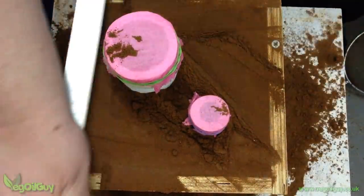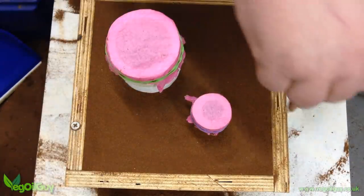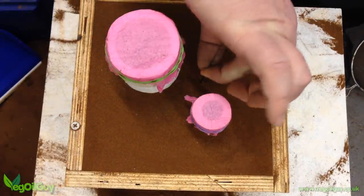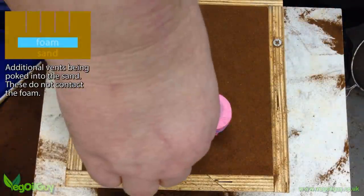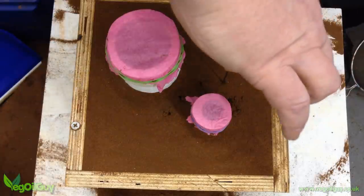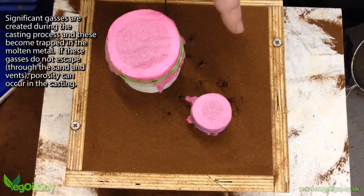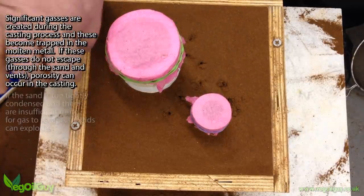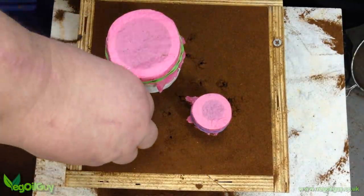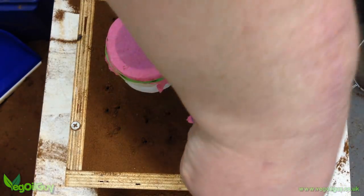Eventually I strike off the sand and brush away any loose excess. Now this is a fine metal rod — it's actually a bicycle spoke. I carefully judge the depth to make sure I don't get within an inch of the foam, and then it's a matter of poking random holes into the sand. It's a tip from Martin that you may have seen me using in another video. Compressing the sand too much is dangerous — as the foam evaporates and even as the metal consolidates, gases are released. These typically escape through the sand, but if the sand is too compressed, they can't pass through it and can dangerously build up and literally explode, which needs to be avoided when you're dealing with molten metal. The plaster feeder and vent go a long way to prevent this, but these holes provide an extra source of ventilation and they really work, as you'll see for yourself in a moment.